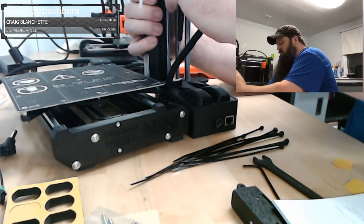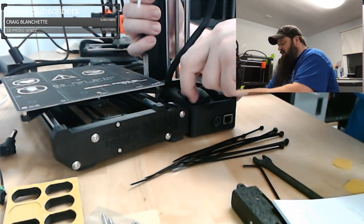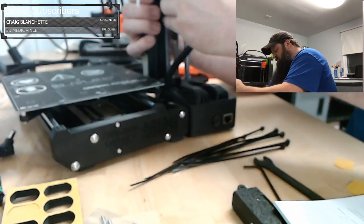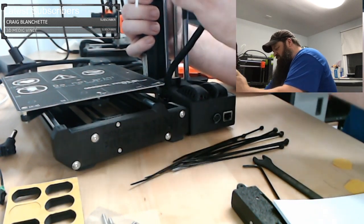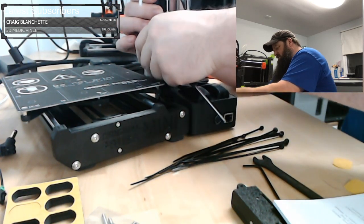Once you open the electronics box, you essentially pull out some cables and get them out of the way. The lead screw right here is kind of free-floating — you can see it wobble. That's done on purpose; it actually helps it print better. Interestingly, the Mini hangs the motor from the top, whereas the Mark III and others have it from the bottom.